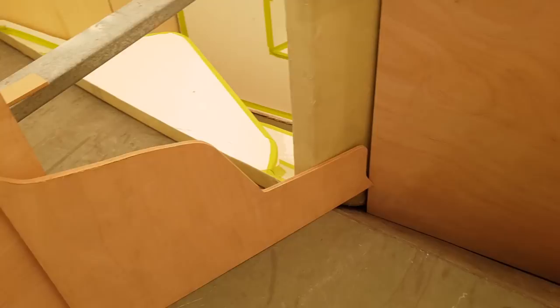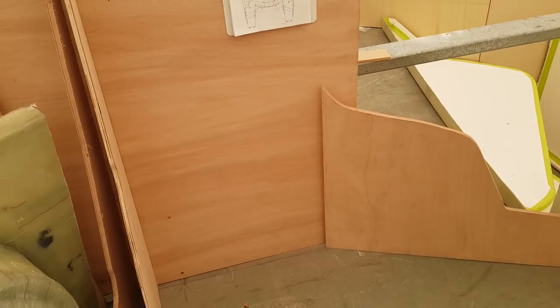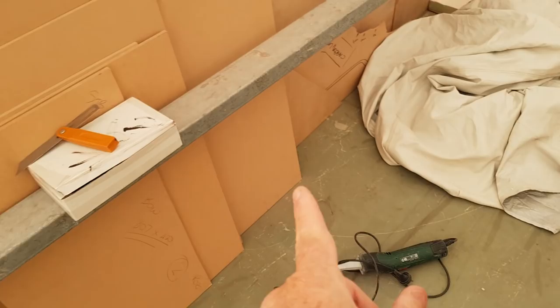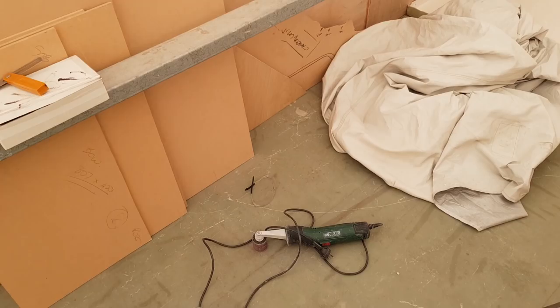That's in. I've got to come up with a piece that's going to intersect all the way from here but end at the bulkhead and continue on to join up with the center masthead bulkhead. I need to remove this part of the central bulkhead — that's where she's going to end — and then continue through to the other side, ending about where the mast is going to sit. A little bit of complicated factoring to do here.